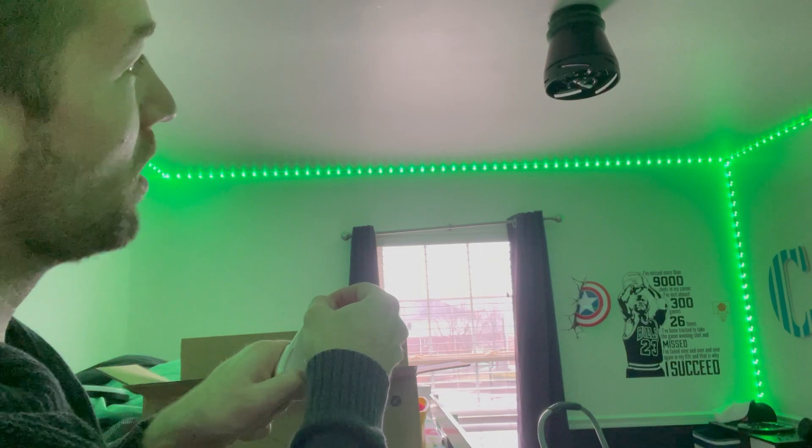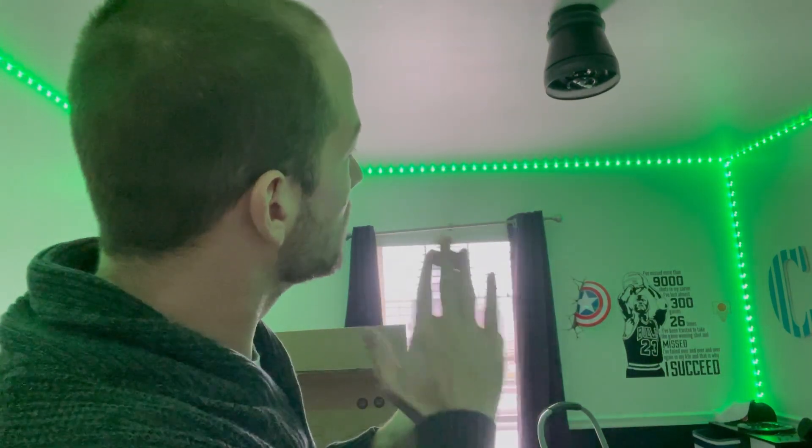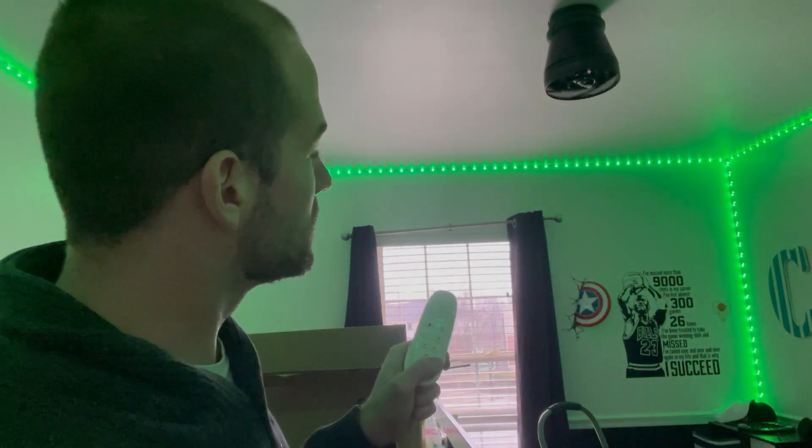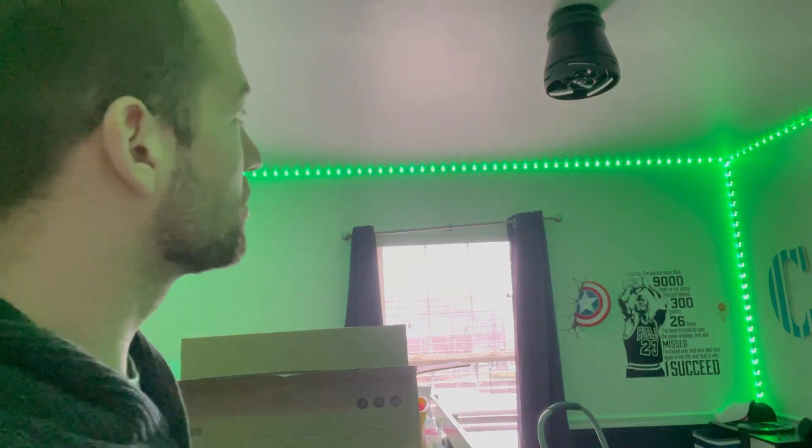I just flipped the power back on. One of the biggest achievements is getting that remote paired. I'm going to flip the light switch, and the instructions said to hold buttons one and two for about three seconds. We can see it's spinning right now — that tells me power is connected and it's on. Let's go to speed one — it should slow down just a little bit, which is exactly what we want. Okay, the unit's working. I'm going to flip off the switch and cut power to it.